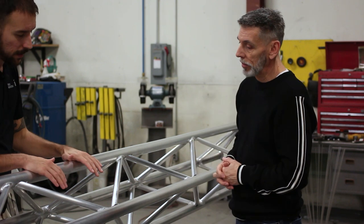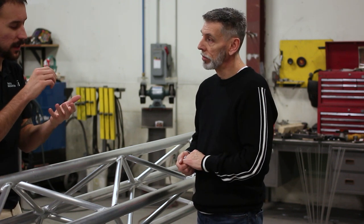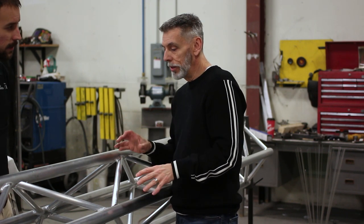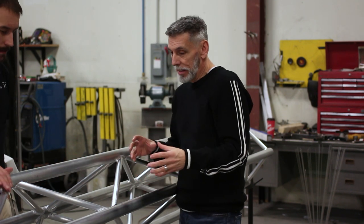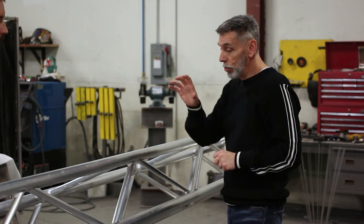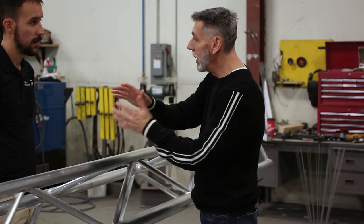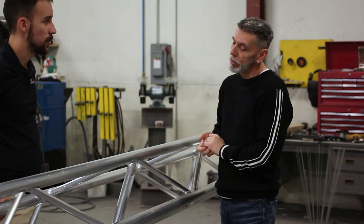When you said a new welder creates more torsion, it's because he welds longer and it makes the truss kind of twist. The particularity with aluminum is that we transfer the heating through the truss, and we have a lot of torsion if we don't follow the right sequence to build and weld the truss. You cannot start from one part, do everything, and move in one direction — we need to go all around and make sure the heat transfer is managed so the truss doesn't bend too much.